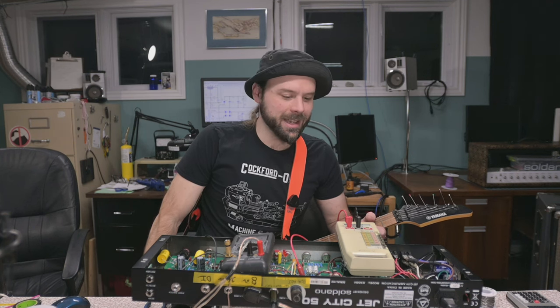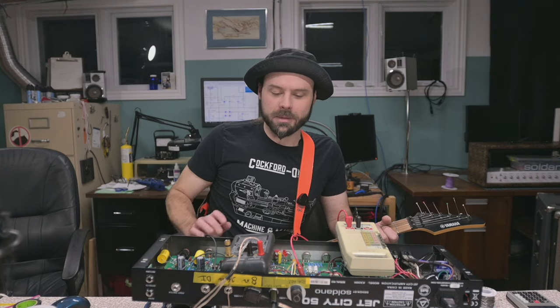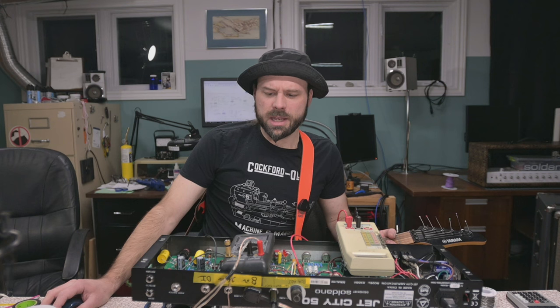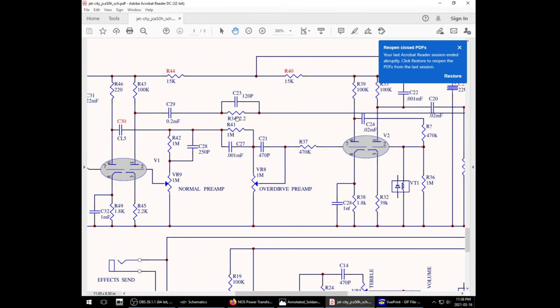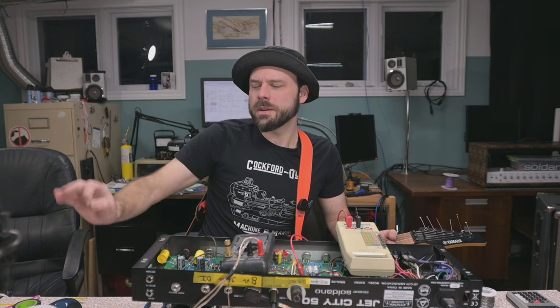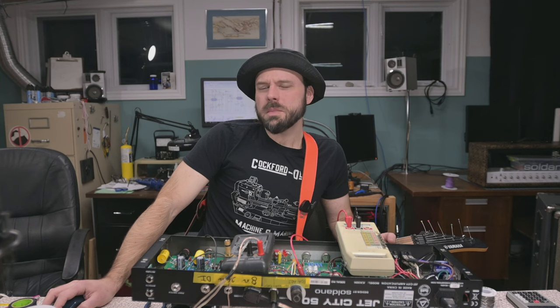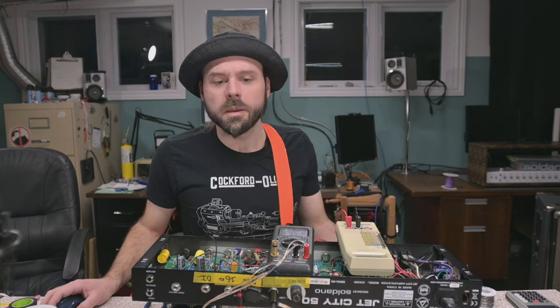Ideas. But hey, I think we're done for now. This has been a long day. It's almost midnight. I'm gonna not listen to loud anymore. I have like one or two little tweaks I wanna do to this guy while I'm in here, little voicing tweaks. I find the crunch channel a bit chirpy, and I think it might have something to do with this 2.2 meg 120p combination right here. I kinda wanna turn that down to a more conventional arrangement, because the crunch channel on this is reminiscent of a JCM-800. So with a little bit of tweaking, I think I can get a slightly more favorable sound out of it.